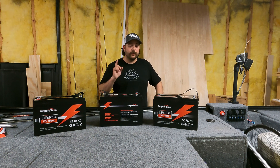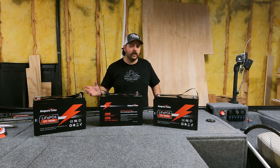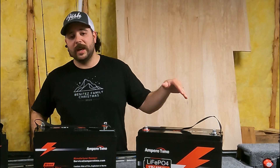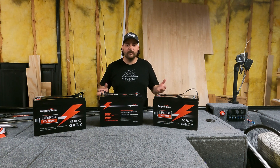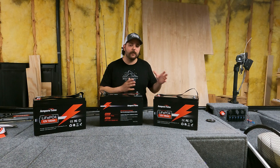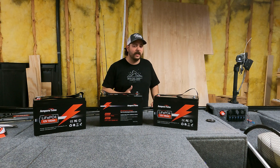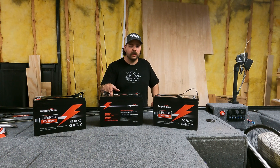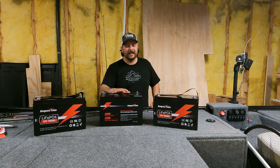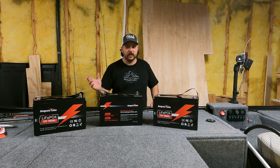So why did I do it? First, I was considering replacing my lead cell batteries — they're about a year and a half in, still have plenty of life, but I can feel they're getting tired on my trips back to the ramp. I use these things sometimes two or three times a week and almost run them dry every time — probably running them a little less than 50 amp hours of the 105 amp hours. With lead cells, you don't want to drain much past 50% before doing permanent damage. With lithium iron phosphate, you have 100 amp hours you can basically use fully — these deliver full power all the way until about 97%.